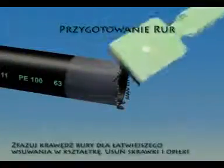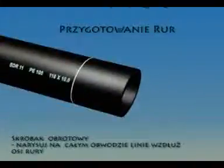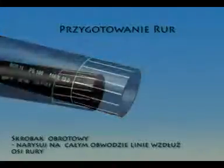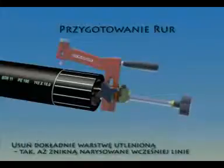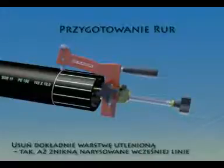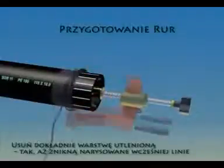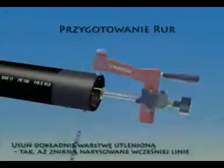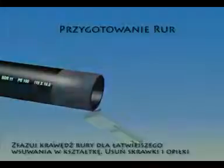When you're done, chamfer the end for easy pipe insertion and make sure to remove all the scrapings. Mark the pipe this way when using a rotational scraper. Make sure all the marks disappear. And don't forget to chamfer the pipe end to remove the sharp edges.